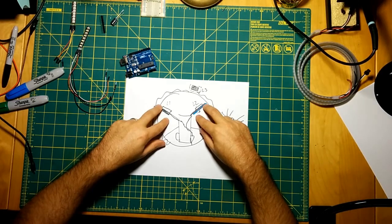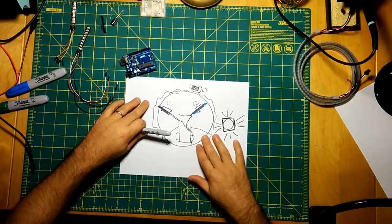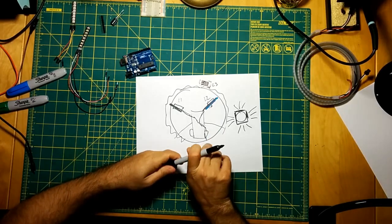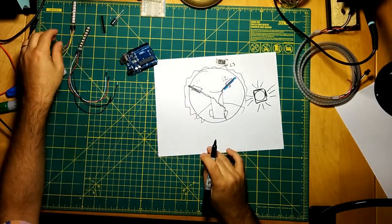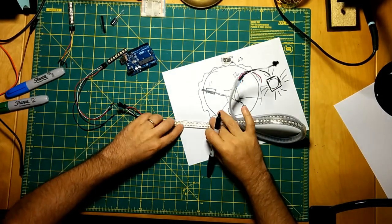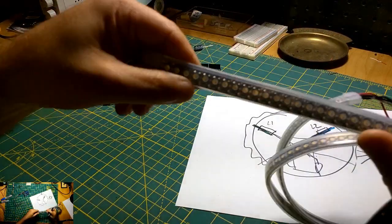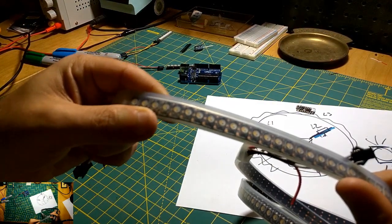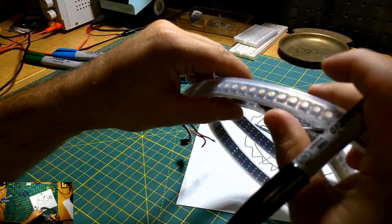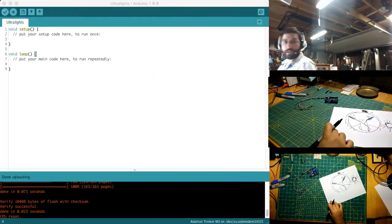It's relatively low power consumption. And what I thought about as far as having them on all four sides like this is the pin layout, right? On these strips, you can basically cut them at any point along the strip where you see those little copper contacts, and wire. You can basically just solder, or they make special connectors where you can connect two clips together.